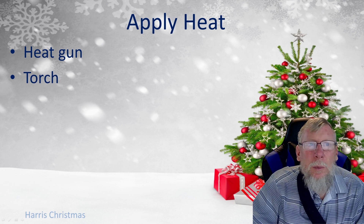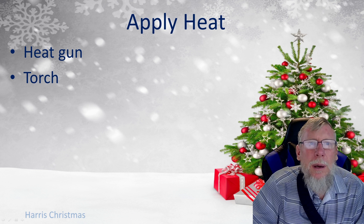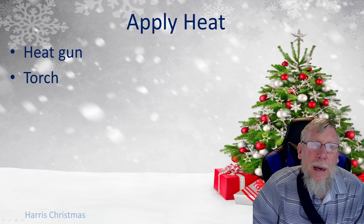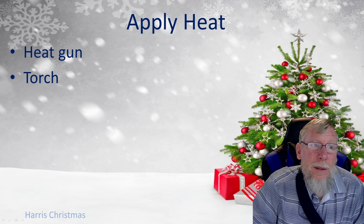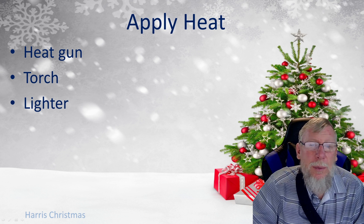You could use a torch. When I had an issue with the solder sleeves not melting properly with the first heat gun, I tried using a torch. But I had problems with it applying too much or too little heat — I'd try farther away, closer, and every once in a while I'd melt a hole in the solder sleeve, and I didn't like that idea. A lot of people have good luck with it; I just did not. And there are a lot of people that have used a lighter — I never tried it; I was just happy with the heat gun.